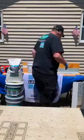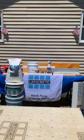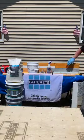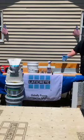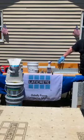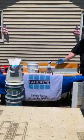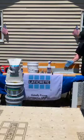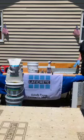Okay, so one thing that I didn't mention, when you're doing this cove, prior to the cove going on, what you want to do is wet out the surface with a liquid neat A and B mixture. So that's going to be called a tack coat. You put that tack coat up prior to your cove going up. After your wall is prepped, that tack coat's going to give you a nice chemical bond to each other so that cove hangs tight up there. After your tack coat's on, you just wait about 15-20 minutes and you go right on wet.